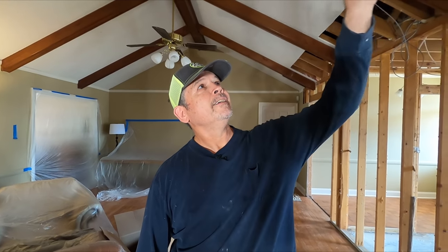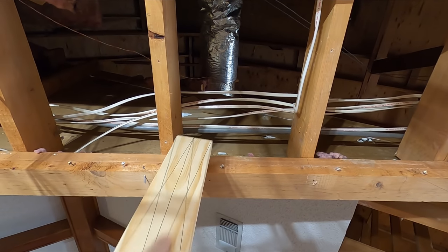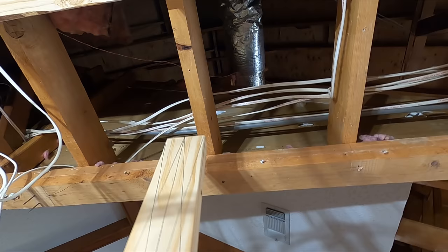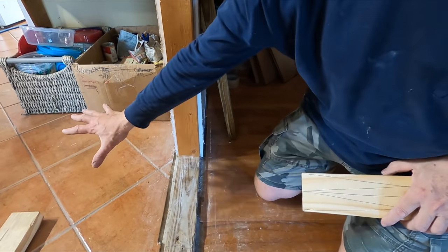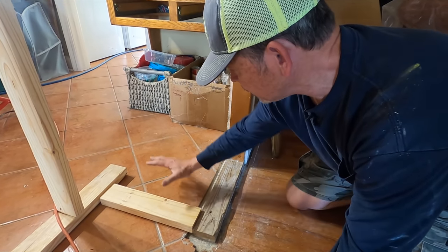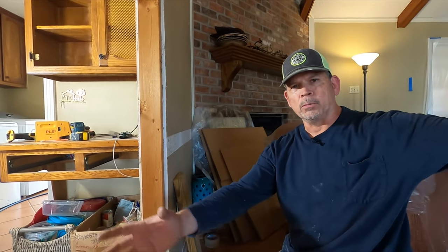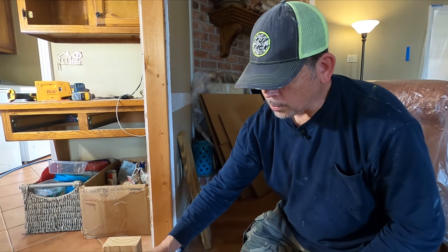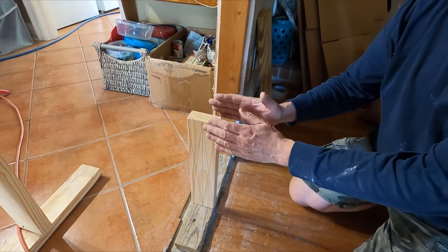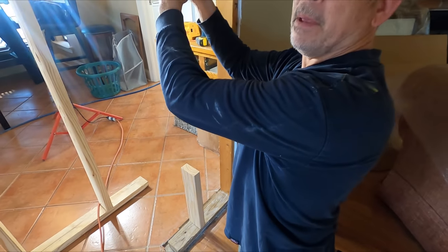All right gang, it's the next day. Jordan and I were beat yesterday after doing all that work. We're well rested and full of energy to install this beam — it's a lot of work. The beam gets installed right up here in this space, and the bottom of the beam is going to be flush with the bottom of these two-by-six ceiling joists in the kitchen and the breakfast area. The plans call for a pantry to go right here, so this sill plate is going to remain and there'll be a new wall here for our walk-in pantry. The plans call for three two-by-fours — a stud pack — to hold up our beam, and then two more king studs on the end to go past the end of the beam.